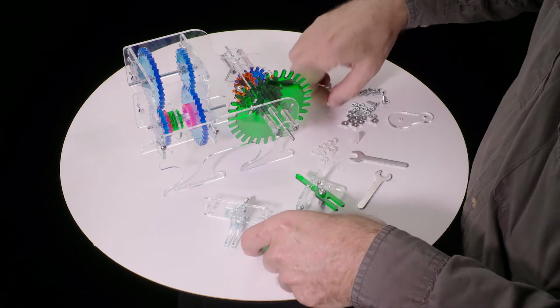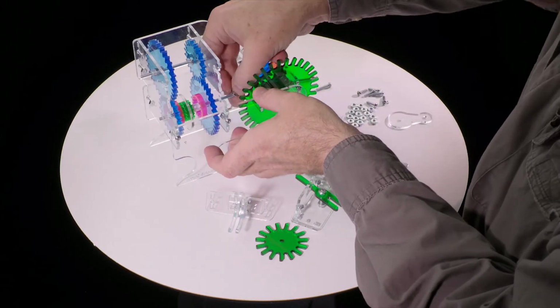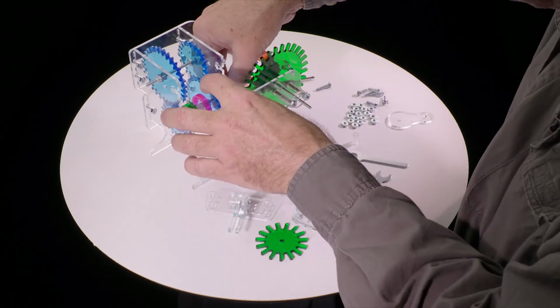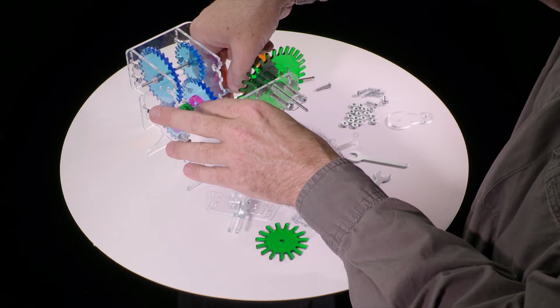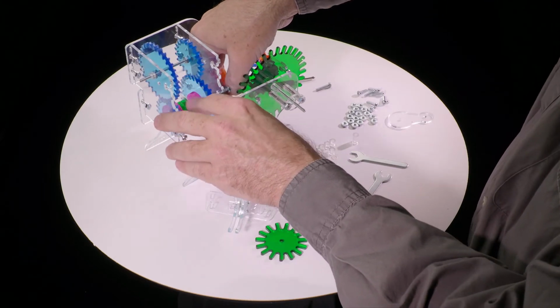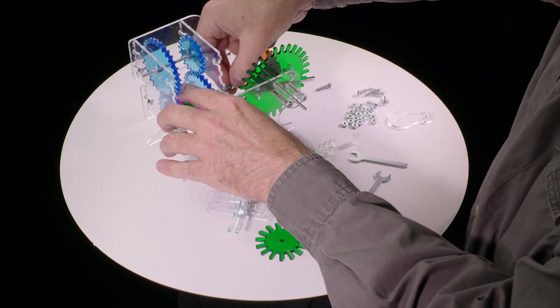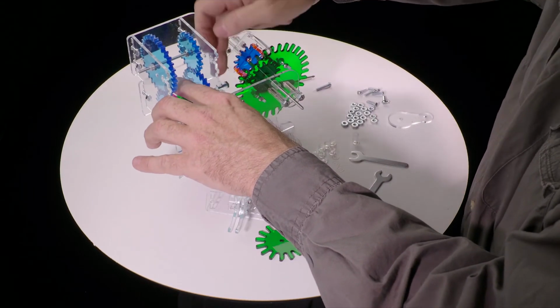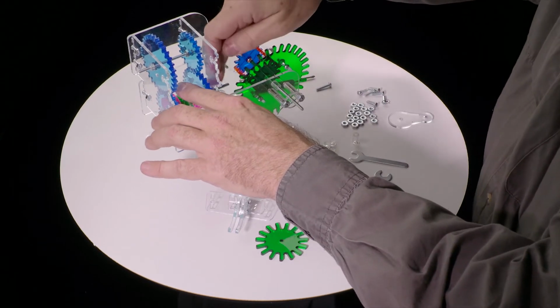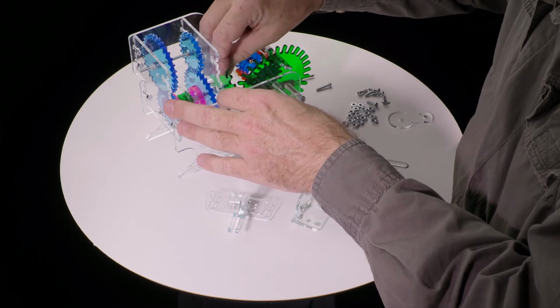So, to attach that gear, we need to get a nut onto the end of this output shaft from the transmission, which you actually can't do by turning the gears because the transmission is not in gear, but you can do it by turning this disc in the middle, sort of hold the nut in place and spin the shaft. That's a good way of getting it started. And back it up farther than it needs to be, and then get this gear on.